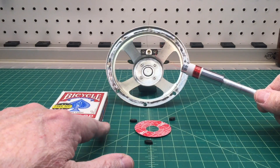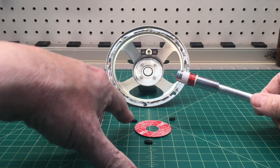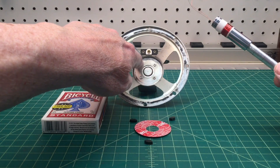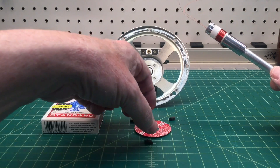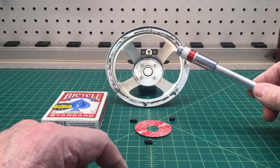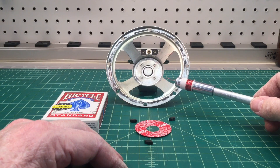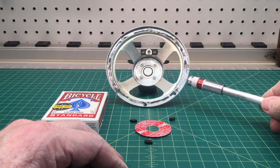I'm back to using playing cards — I cut one out at about a two-inch diameter for the spider. I took rubber washers, cut them in half, and I'll use some epoxy to place them at several locations. Then I'll glue the playing card down and this will become the spider for the voice coil. I'm not going to put a normal speaker cone on the speaker — I'm actually going to create one out of craft paper.